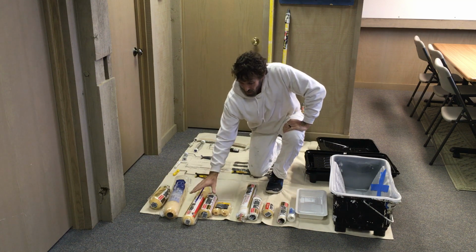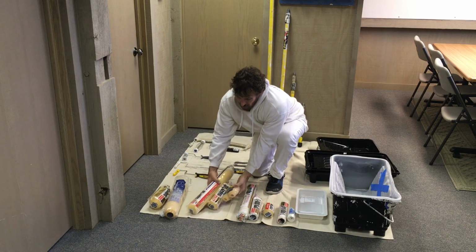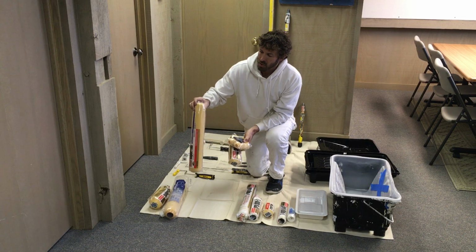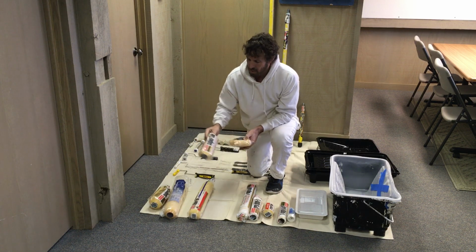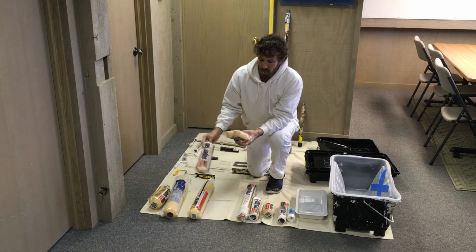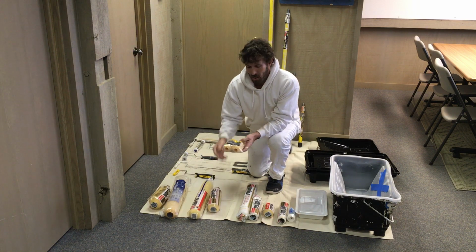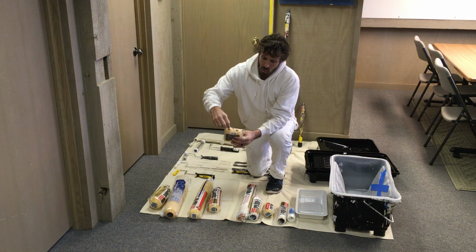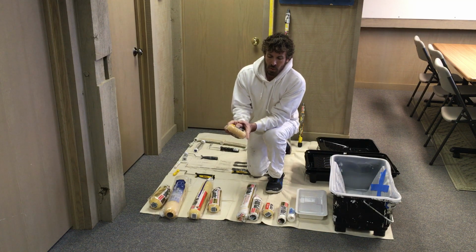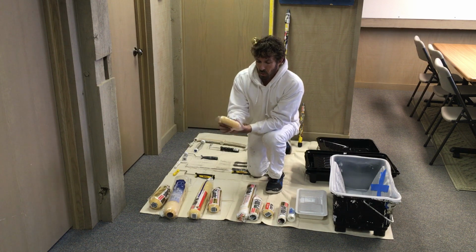We then step down in the thickness to 3/4 inch nap. That's what these 3 covers here are. So we have our 18-inch, 3/4 inch nap polyester cover, our 9-inch, 3/4 inch nap polyester cover, and then we have something that we call our jumbo mini. It's an oxymoron, I know, but that's also a 3/4 inch thick nap, but they're 4.5 inch. I think I said 4 inch, but they're 4.5 inch. And those we will discuss on what we use those on in a little bit.